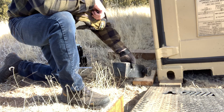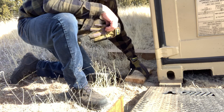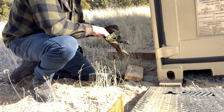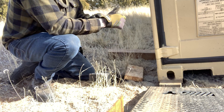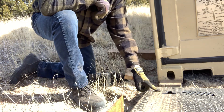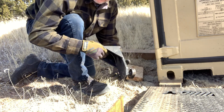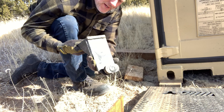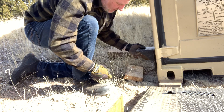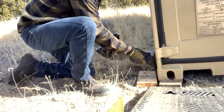It cleats into the side — you see this hole right here? These knuckles, these corners on shipping containers will all be the same, and that goes in there like so. Let me get my glove back on to protect my hands. The idea is we want to get this thing off the ground about six inches to scoop the tail end underneath and get it to about right here. Once I scoop it onto there I can slide it underneath the trailer pretty easily. It's a little round edge, same size, so it goes in this way and when you turn it this way it's kind of locked in — same thing all containers use for any container attachment.